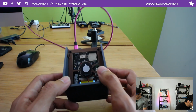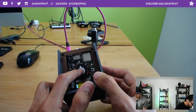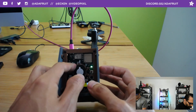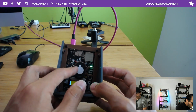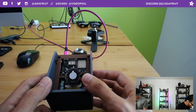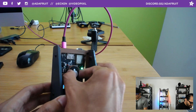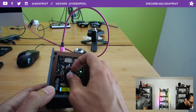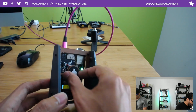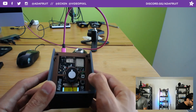We wanted to amplify the audio. There is a built-in buzzer, but we really wanted to put a bigger speaker in here. We have these really nice mini oval speakers, and they already have the Molex Pico connector, which just plugs into the back here. Plug it in, and it switches automatically. The mounting plate has a nice little spot for the mini oval speaker. It has little peel backings with adhesives, but I didn't need it here because I like the ability to pop it out. So it's just pressed in there.